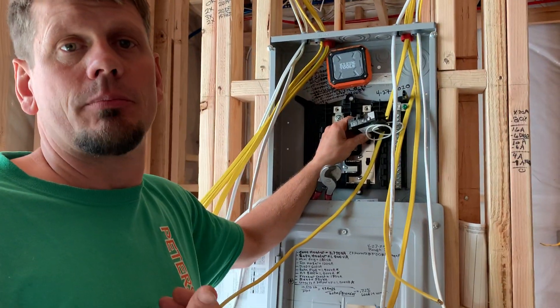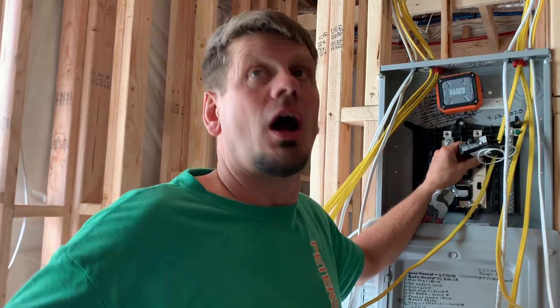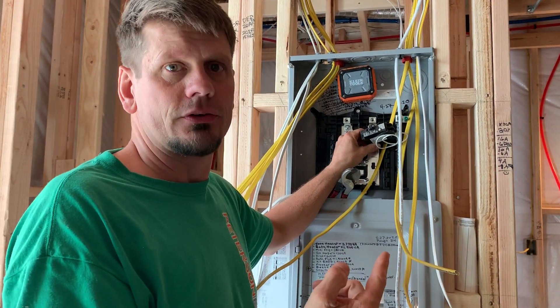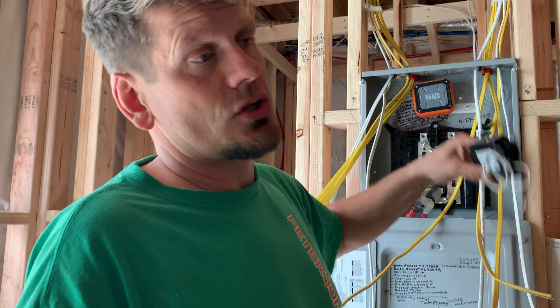We have to actually bring down that sub panel ourselves and wire the whole basement. If it starts and stops — if you're not going to finish the basement but just put in a couple circuits in conduit coming down the wall so you can run exercise equipment — then that's not considered a full basement, that's just a couple circuits you need. But for us to run a couple circuits and then have someone come in behind us and rework the whole thing without telling us — that's a problem. There are insurance reasons for that protection for the customer as well as us. If there's an electrical issue, you're on the hook — it ain't going to be on us. You've wired one basement before; we've wired 22 years of work.